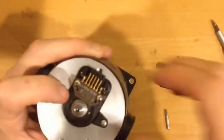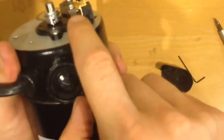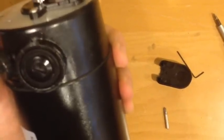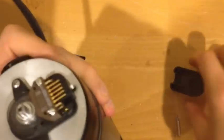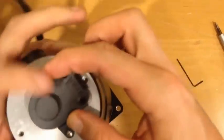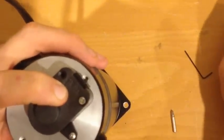Okay. Oh, see, I almost did it again. Okay. So this is what I like to do, is make sure there's clearance now. There should be clearance between the disc and the sensor. So it holds up to a light source, but I can kind of tell right now if I spin the shaft, it's not rubbing. I'm assuming that's all I need to make sure that it doesn't do is rub. So let's go ahead and put this on there. Switch back to a Phillips.